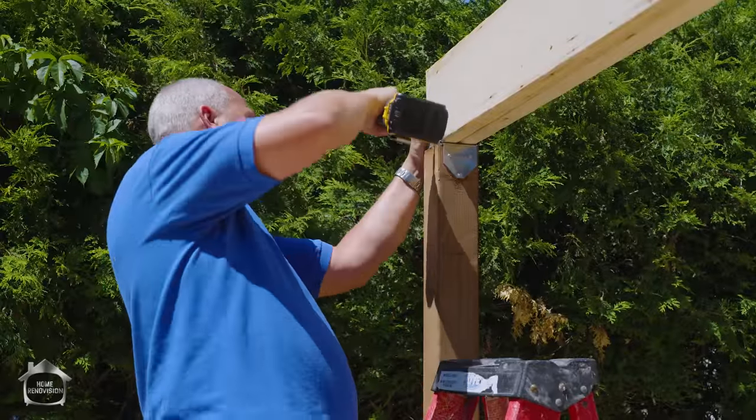The next thing we want to do is put two-by-fours on end to frame in our roof. What we're looking for is the slope, because the same angle here will be over there but on the other side of the wood. Here's a system that'll work every time when you want to translate an angle. First, measure the height of both posts. I'm at 92 and three-quarters; the other is 81 and a half. To do the math with the same denominator, that gives me 11 and a quarter as the difference in height.